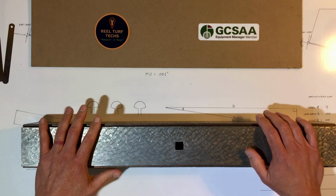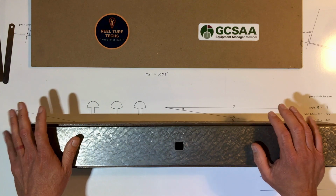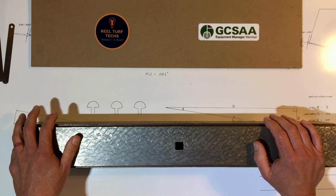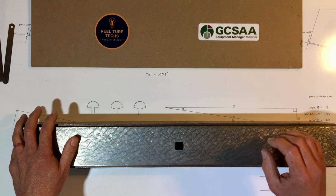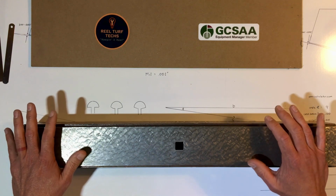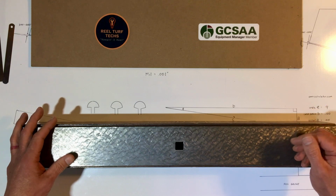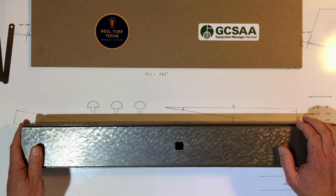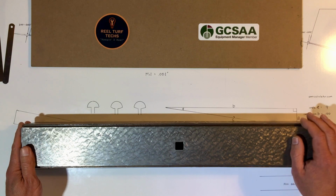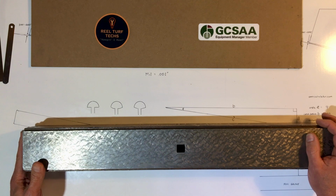So it allows me to check and calibrate a height of cut gauge several different ways, quickly and accurately. It checks the gauge for flatness. It will calibrate the gauge whether it's flat or not. It measures the amount of deflection in hands-free mode, and it will show you if your catch is tapered enough for your cutting units.